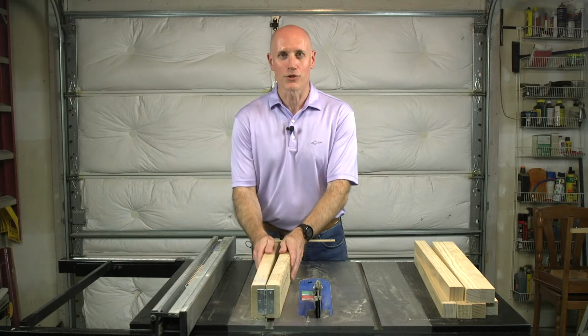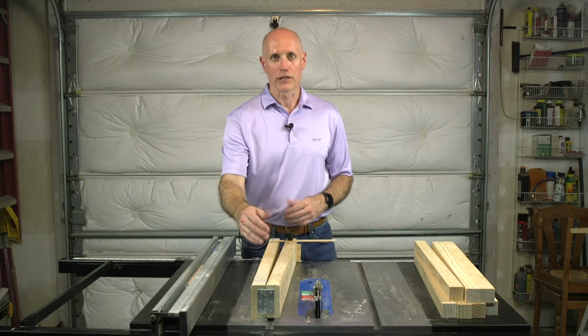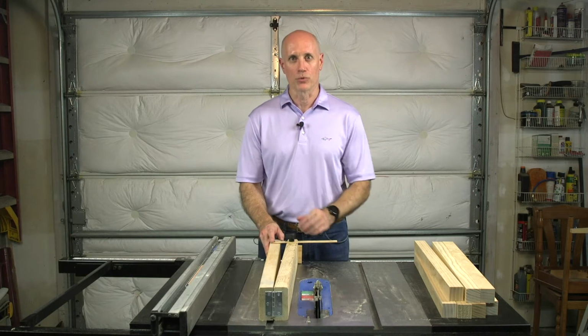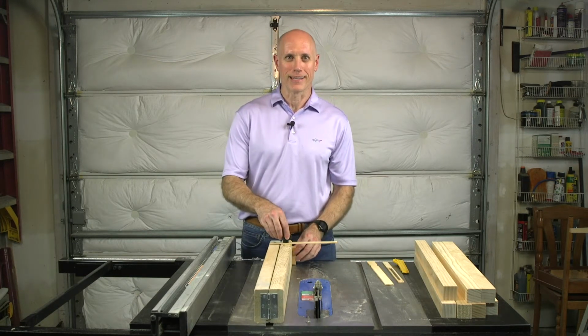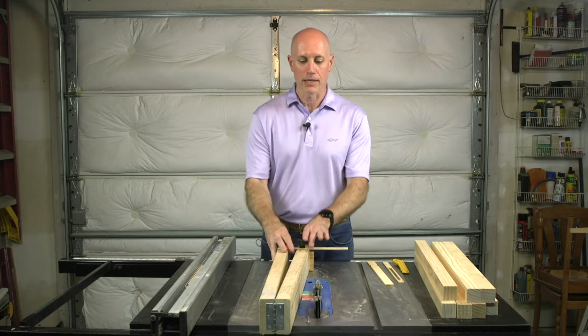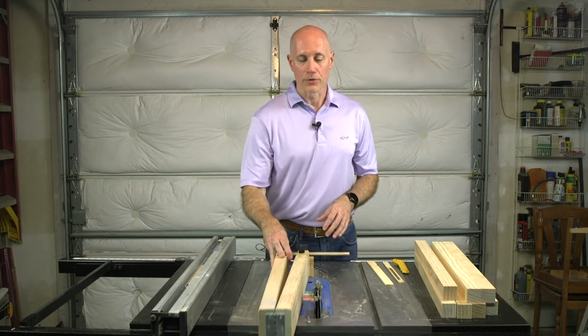I've got two pieces of 2x4s a little over 2 feet long, held together on one end with a hinge, and on the other end I've got a little cleat to help push the wood. I've also created a little sliding mechanism that allows you to measure the appropriate angle for the taper cut, lock it in place, and then run the wood right through the table saw.